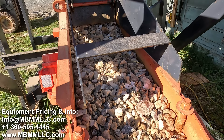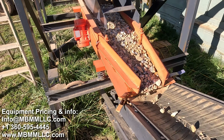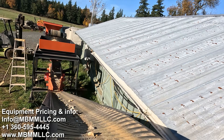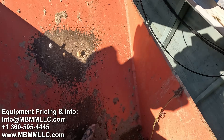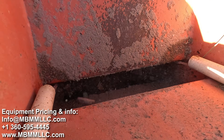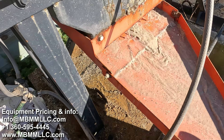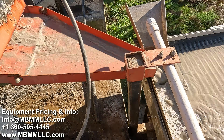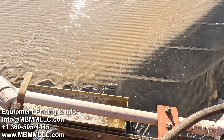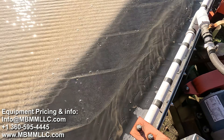This orange vibrating tray under the hopper evenly pulls material out from the bottom and feeds it onto our hammer mill conveyor. The feed rate is adjustable with a VFD so you can tune the hammer mill right where you need it. The crushed ore falls into the hammer mill hopper and down into the 20 swinging chrome hammers, which crush it until it goes through a 0.8 millimeter screen. The hammer mill runs wet to keep dust down and to make a nice slurry that feeds right onto our 4x8 shaker table. The shaker table has grooves where dense minerals settle and are pulled across to the cleaning plane — the top three grooves and the long fourth groove bring most of the gold, tellurium, and other heavy dense minerals up to the cleaning plane.